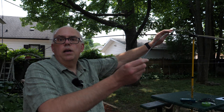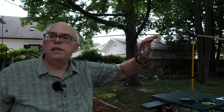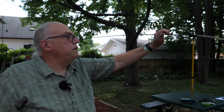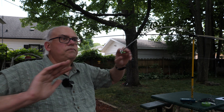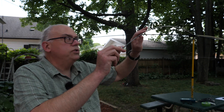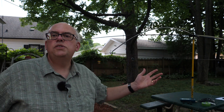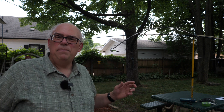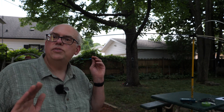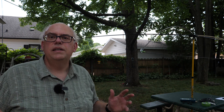Some people wondered about flexing the poles upward instead of letting them droop down. That's a possibility — I think I can do that if I come up with a better solution for these corners. As it is now, if I try to flex this upwards, the wire has a tendency to pop off the corners. So we're going to keep it as it is and let it droop down. But the droop is a lot less than what it used to be, so it's not such a big deal. Let gravity do its thing — that's one less thing to worry about. So that's the update on the Moxon antenna build. The next video will be a full report on how this thing actually worked in the field at field day. Stay tuned for that. I'm Michael, KB9VBR. Have a great day and 73.